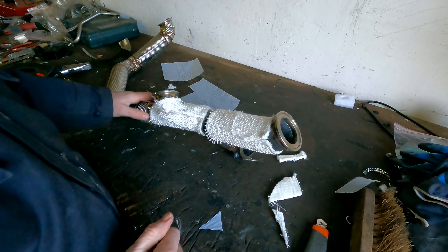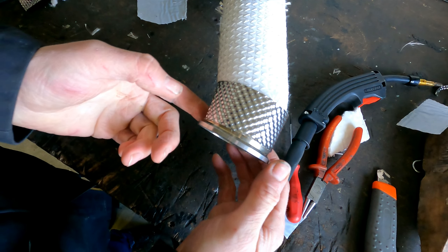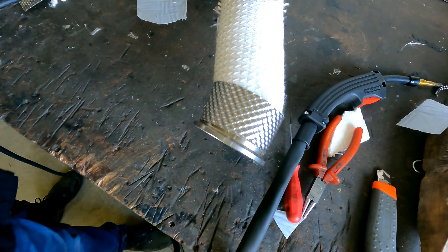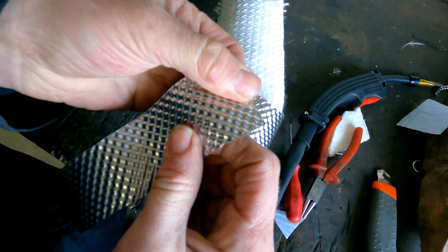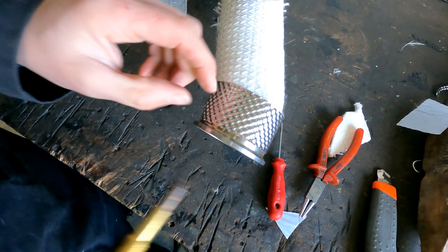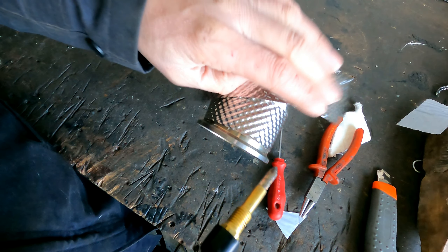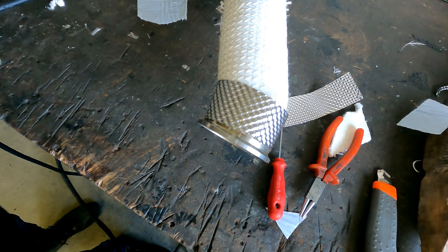I'm going to put the rest on and show you how it works with the stainless steel. I've got the machine on. I stick this stainless piece around it here — it's a small piece because it's around a bend. This stuff you can move and bend a little bit but it's not completely perfect. You can also do small corners at the same spot, but very tight bends are not possible. Around the flange here you just tack it. On 0.1 mm you really have to tack in a second, but where there's more material you can hold it a little longer, otherwise it does not stick.